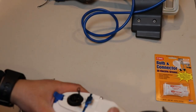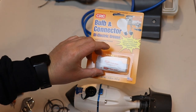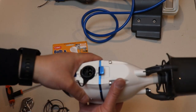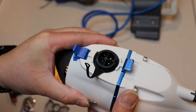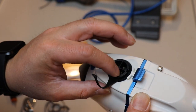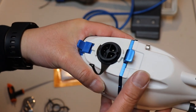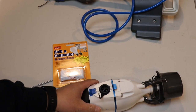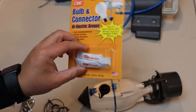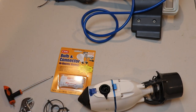The reason you're gonna need this dielectric grease is to prevent corrosion. For all of the connectors — especially because I use mine in salt water — you want to squirt dielectric grease inside of the connectors to help prevent corrosion. I would still do it even if you just run it in fresh water as a precaution. Maybe after every season, clean it out as best you can and then put fresh grease in there — some people do it more often than that.